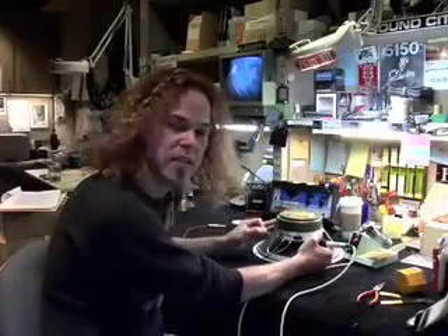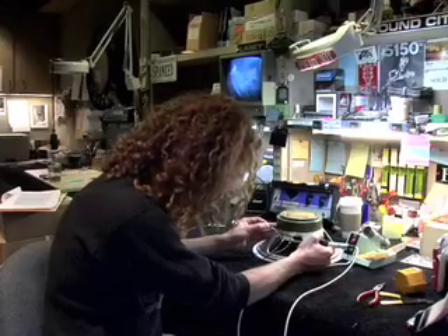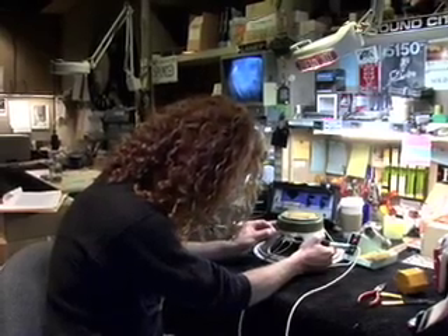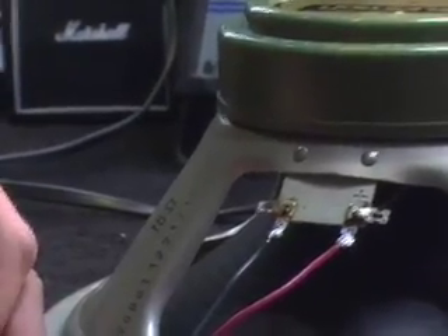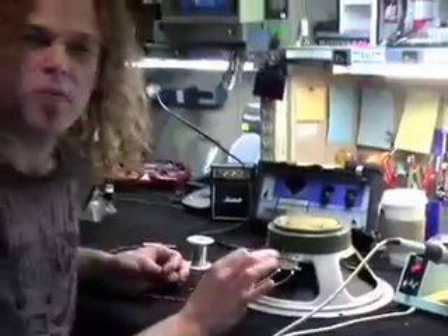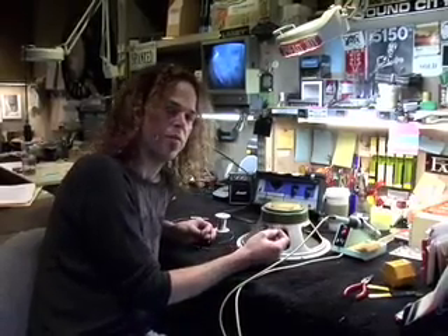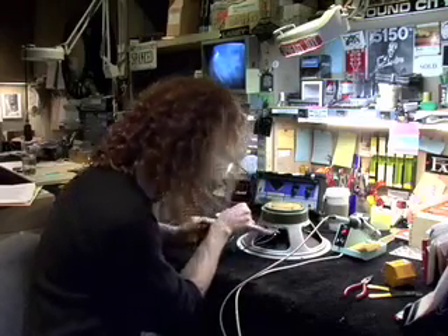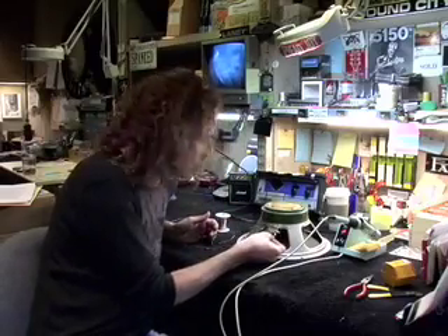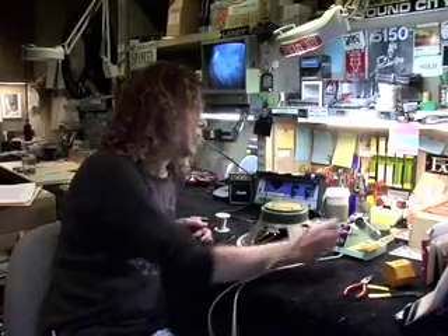Take your iron. You've already got solder on your wire and solder on your lug. Lay the soldering iron down to create some heat, then lay the solder into the area you want connected. Same with the black, the negative terminal — lay it on, create some heat. You don't want to leave the iron on any longer than you need to, only as long as it takes to make the solder molten and connect with the terminal and the wire. Your joints should look clean — no black residue. They should be clean and bright silver, meaning no residue and no jacket accidentally melted into the connection.